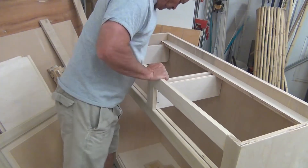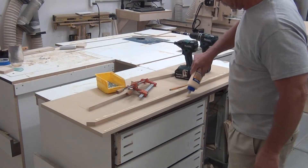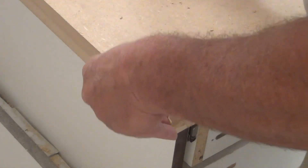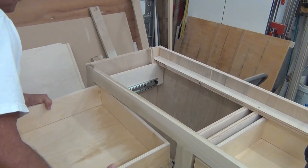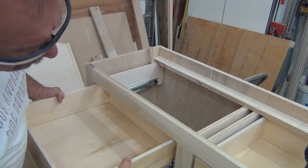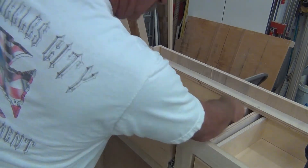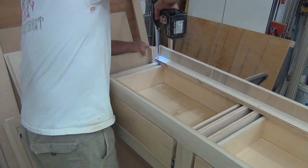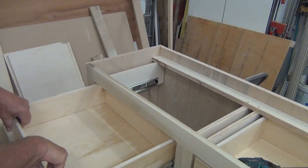Mounted an additional rail for the inside door. On my top, I faked the inch and a half thickness and just built up the edges — glued it, mitered it, sanded it, and rounded it over. I leave my drawer support rails loose, then I slide the drawer in, make sure that it slides in and out real nice and easy, get the support rails where they need to be, then screw them off. You'll have to watch my drawer video to see how I make drawers. It really makes for a smooth operation.